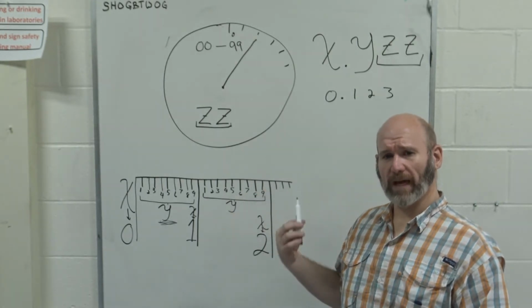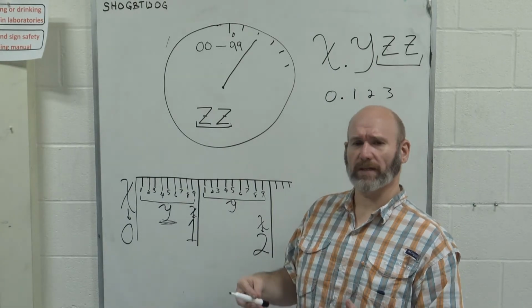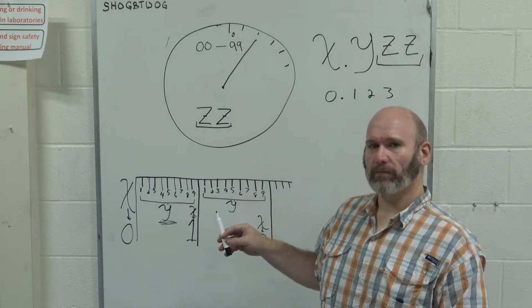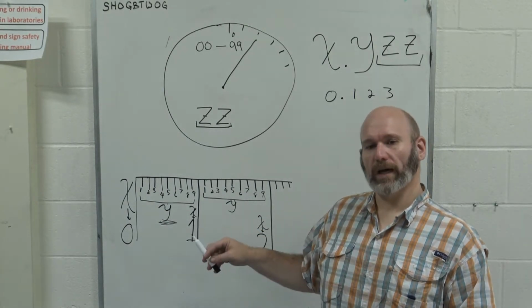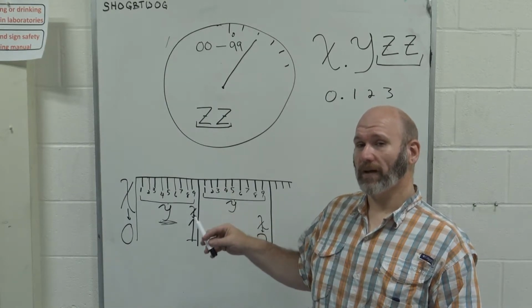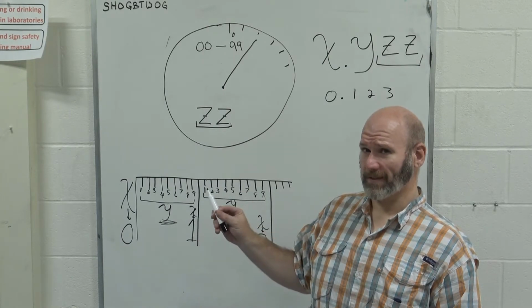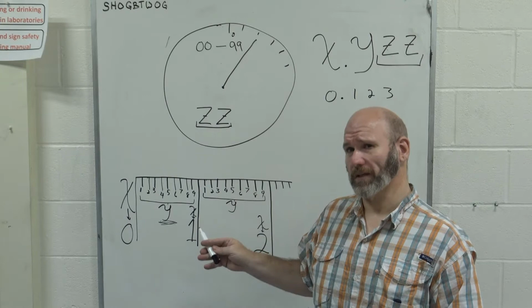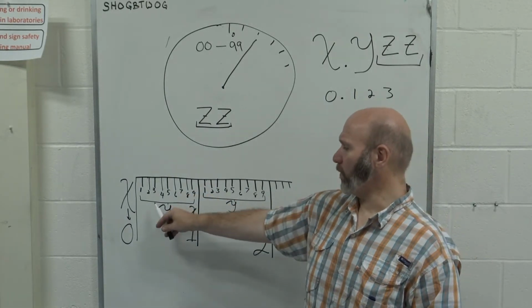And if you refer back to when we said how big is 1,000th of an inch, or how big is 3,000ths of an inch, if we're at 397, we are only 3,000ths away from 400 thousandths. And if you remember, that's less than a sheet of printer paper thickness away from that value, which means that we are right on top. So you're going to be able to see that value in the Y.